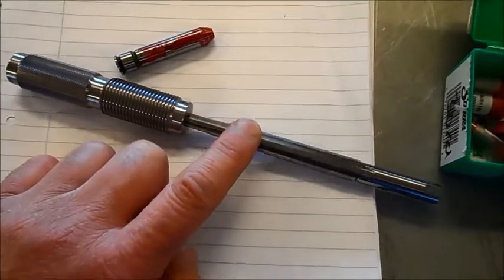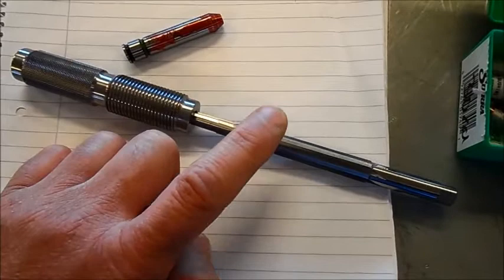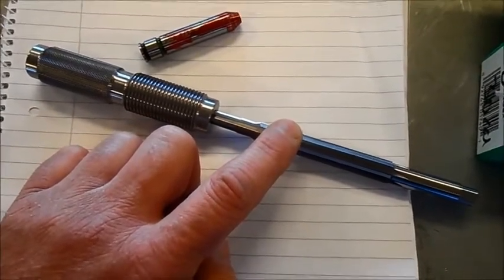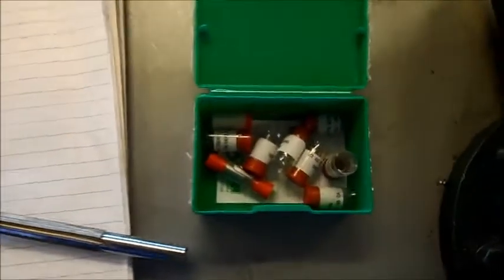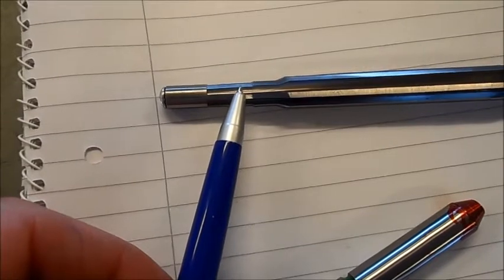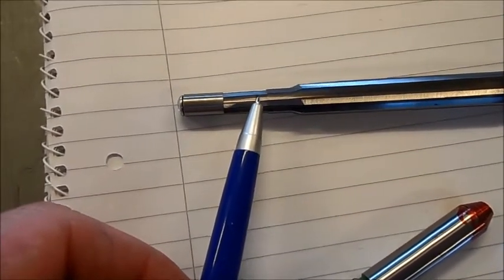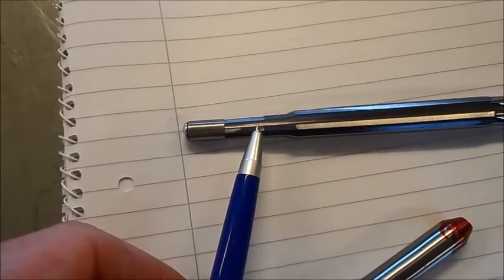It's sunshine outside and I want to go home. Should I bore it, ream it just with the reamer, or should I bore out the hole? Here is a different kind of 30 cal. Here there's a straight section - it's 0.0005 over bullet diameter. So that one I'm not going to bore away. I'm going to backbore my die until here, so this portion of the die will line the bullet up within 0.0005 to the case. There's slop here so it's not perfectly correct, but it will line it up. It will reference out of here - it will line the bullet up very well.